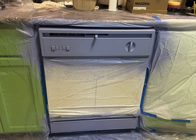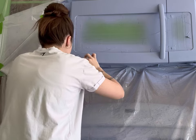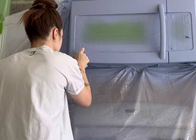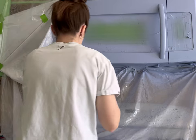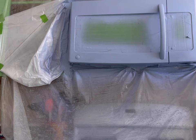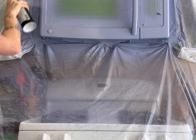After the first coat I started the second coat. I did run into some issues where I accidentally rubbed up against the microwave and smudged the paint — but all you have to do is let it dry fully, sand those areas down, and put another coat over it. Super simple. If you notice a drip, don't touch it — let it dry, which might take a few hours, then sand it and do another coat. It looks good as new. This turned out amazing.